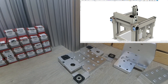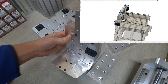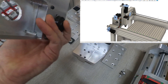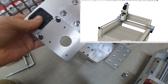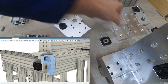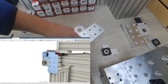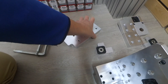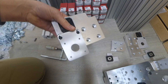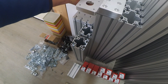These are the motor mounts — all very much the same design. This one is for the X-axis, and these are for the Y-axis. I changed the design a little bit because if I needed to machine the Y-axis part from one block of aluminum there would be a huge loss of material — just a waste. So I changed the design so I could easily bolt it onto an 8080 extrusion as well.